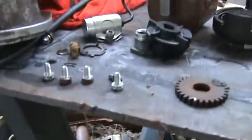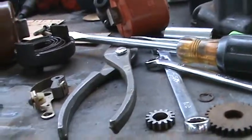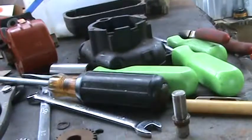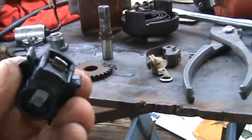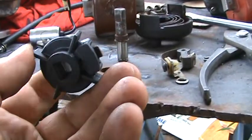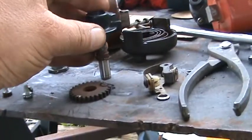Rust makes it hard to build good clean current, but yeah, I've got a mess and we're gonna try to put it back together and see if we can get one of these to fire. If I can get it timed — the main thing is you stick your rotor button in. This is called a rotor button — I call it that, I don't know what else they call it, but it's a rotor button here in the states. It's pretty well keyed to go one way.